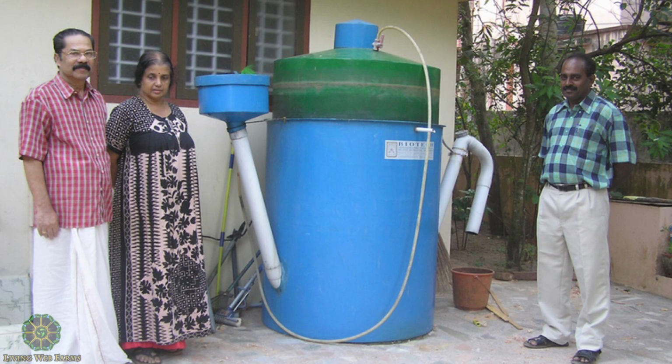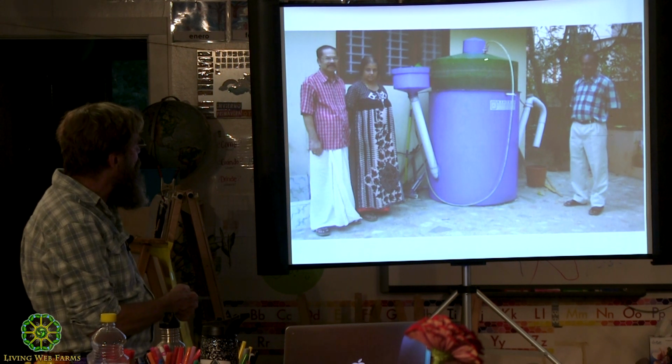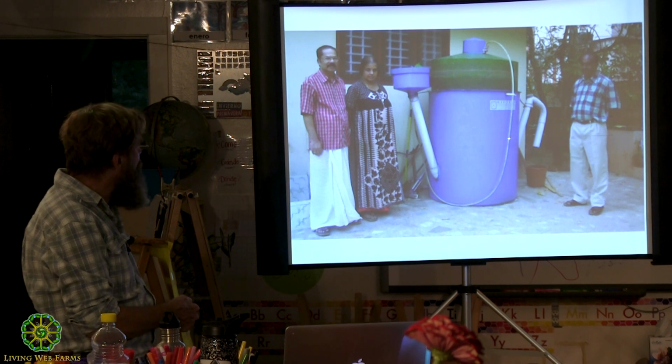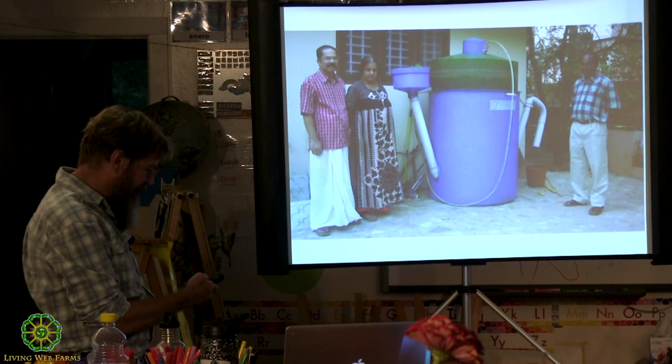What I'm taking to be an Indian or Pakistani one, maybe. It looks like a manufactured unit out of plastic containers. This looks to me like a floating system. In other words, that's the slurry tank, and that's the gas chamber. That gas chamber goes down to about that point into the water. The weight of that tank on top is what provides the pressure, and it floats on there, and it's tight enough. And I've built these at Mother Earth News.